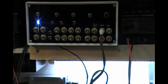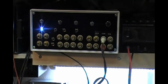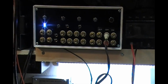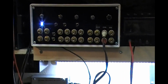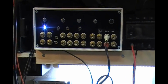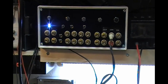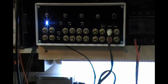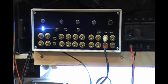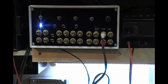Other than that, when I got it all hooked up, I think I mentioned before, there was this persistent low-level hum. And I'm going, I don't know why. Manufacturers managed to use one power supply to power all aspects of their amplifier or receiver, but I couldn't manage to do that. And this goes back to the previous original bench amp. So I thought I'm going to have to put another power supply in that gives me plus or minus 15 volts.